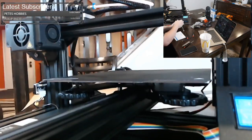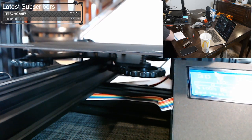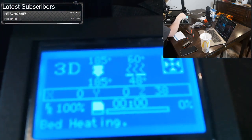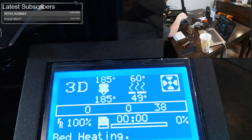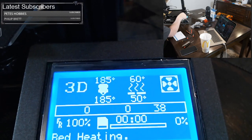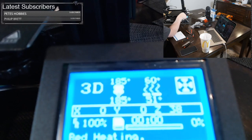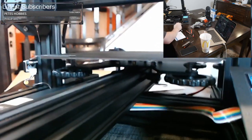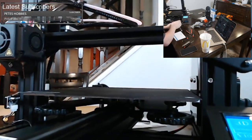Now, I eyeballed the leveling of the bed. So this is absolutely going to find out if the bed is level, what it needs to be. First thing it's going to do, because of how my file is set up, it's going to heat the bed to 60 degrees. So we're at 49 degrees right now. You can see on the top right. And it's going to slowly climb to 60. Then it's going to heat the nozzle to 210, I believe. So we'll see all that happen. And then we should start seeing some prints come out.